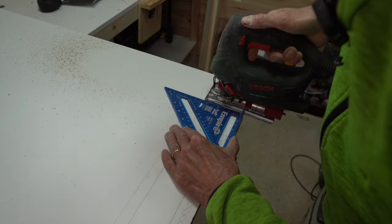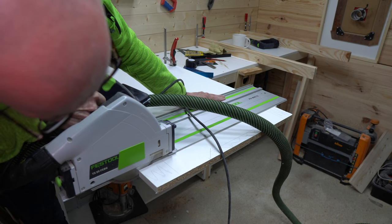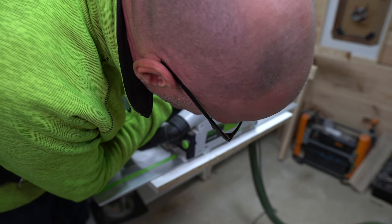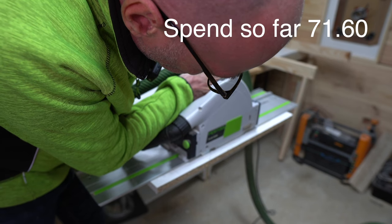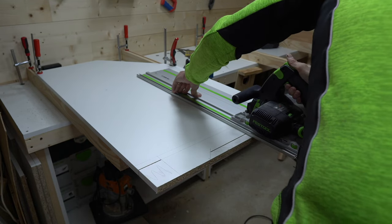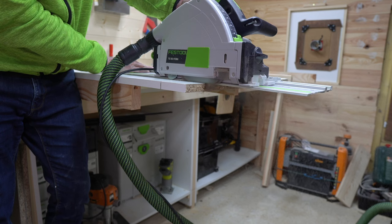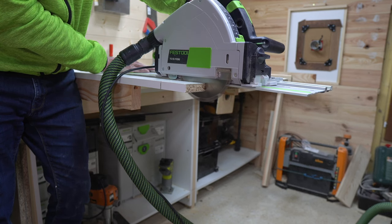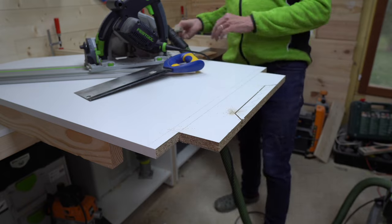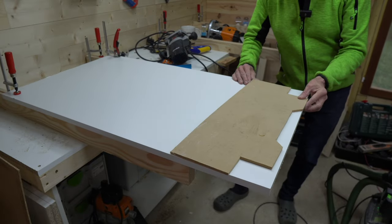To address those two comments: firstly, the feet in my local DIY shop are €2.50 each, so to buy the feet for these wardrobes would have cost me €30. The melamine I'm using costs €17.90 per sheet, so the four sheets cost me €71.60. The feet would have been more than 50% of the cost of the wardrobe build so far. Secondly, because I'm building this wardrobe under the eaves and it's only half height, I could not afford the extra height a plinth would have provided. The clothes on the hanging rail will hang almost down to the floor to maximise the internal space of the wardrobe.